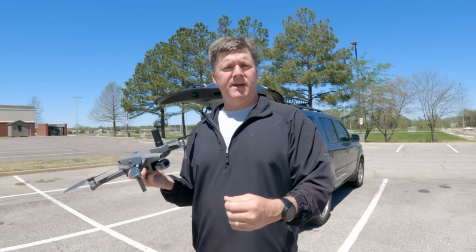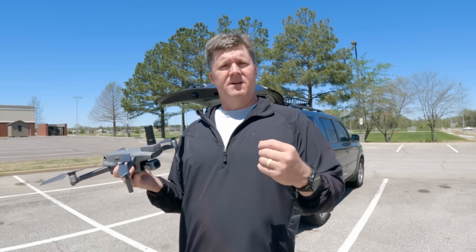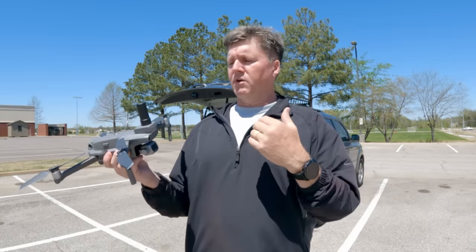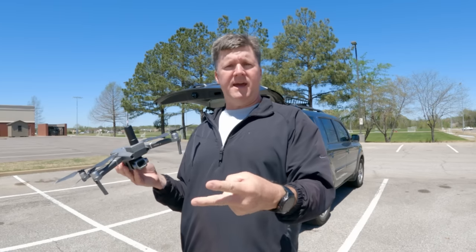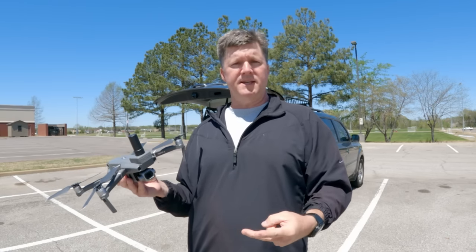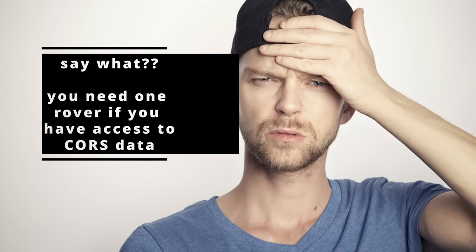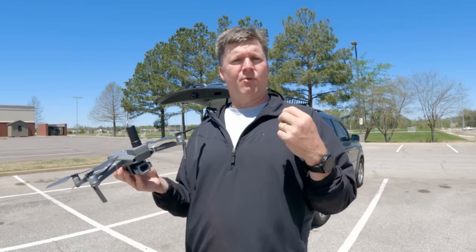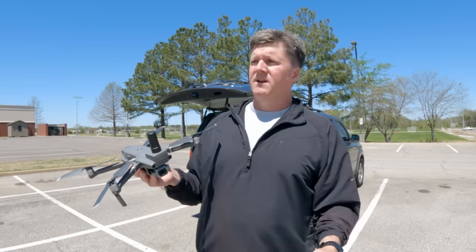When you get ready to provide data to surveyors, engineers, and construction companies, it has to be very accurate. When you are going to get into photogrammetry on a professional level, you have to have, at the minimum, a GPS unit to serve as a base. You've got to have a base unit, and then you're going to have a rover for doing your ground control points.